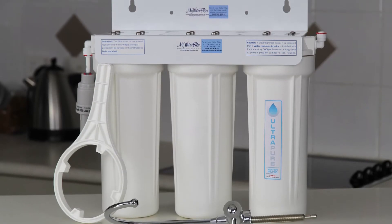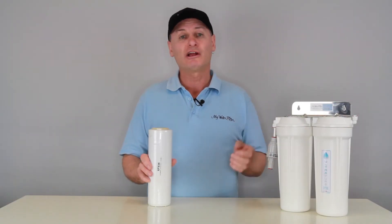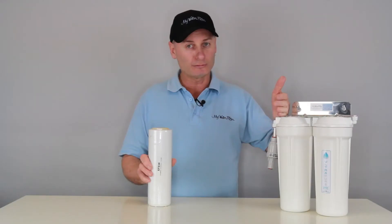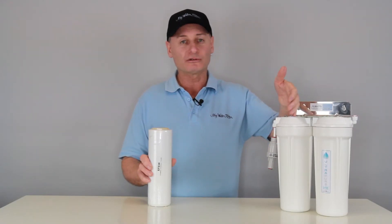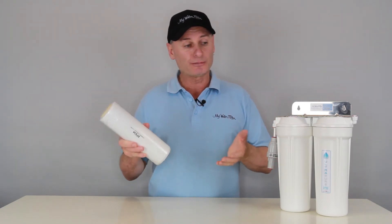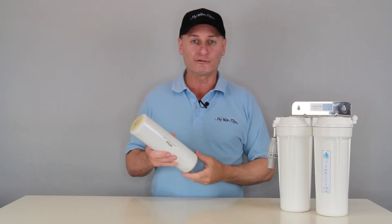So if you don't have sediment protection out the front, you don't really want to force that sort of sediment into one of these cartridges. They really do work best if you've got a form of sediment protection in front of them. So I'd say grab a triple, and then in the triple, the first stage we just put a nice little polyspun sediment cartridge in there — that'll block all of the rubbish — and that will leave cartridge number two for the Corus X to elevate pH, over into the ultra-pure, clean it up, stop the bugs, and we've got beautiful water.